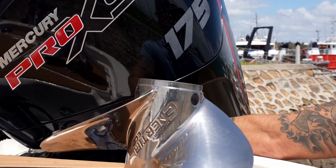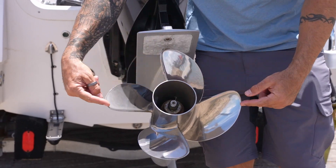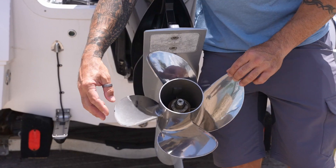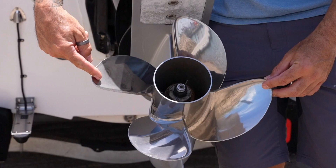When it comes to pitch and diameter, some general rules: the larger the diameter, typically the slower the boat; the larger the pitch, typically the faster the boat. So if you're looking for a fast prop, you want a higher pitch and smaller diameter. If you have a heavier, slower boat, you'll have a bigger diameter and a smaller pitch. Prop diameter is the distance from tip to tip — imagine it spinning in a circular motion, and the outermost edges of that circle is your prop diameter.